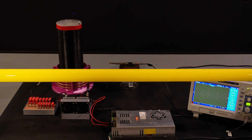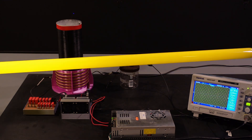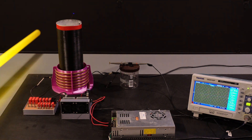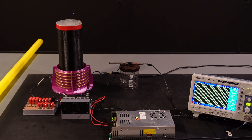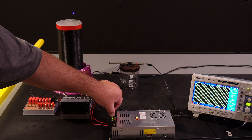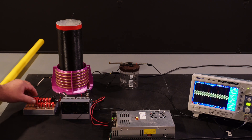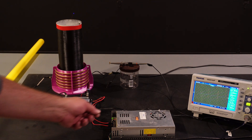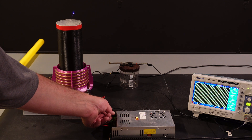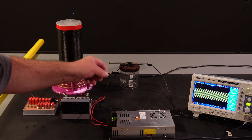There's a four-foot light right there — that's pretty good, it's lit up. Not a problem. Bring it close, bring it further away — we're still holding good. We can see right here we got a breakout. Let's see if we can increase it. My body capacitance did that — bring it right back down, take it back out of tuning. Re-tune it, put it back. My finger was touching the metal here — I shouldn't be doing that. There we go, we hit it again.